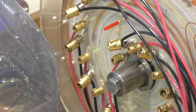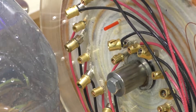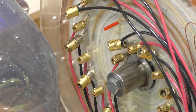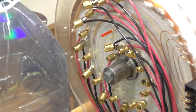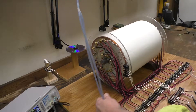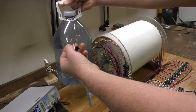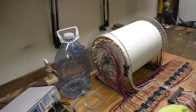Here's how I got the water in. You can see that little red tube — when I built the end plates, I made an individual hole for each cell. I just stuck those tubes in there and used a gravity feed system: a bottle of water, some silicone tubing, and a couple of clamps. I hooked those up to the cells, released the clamps, and let each individual cell gravity feed and fill itself.